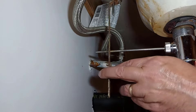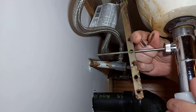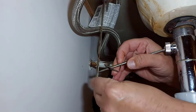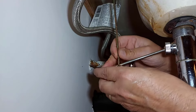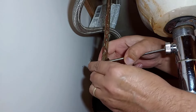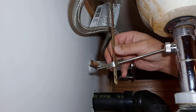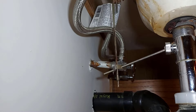Hopefully that is an easy fix for you. All you've got to do is run this clip through here. Your clip may be compressed — you can spread it open wider so it creates friction on this rod. You want to run this clip through here first, and then run the rod — or that drop-down bar — through it. You can fit that clip up on that horizontal rod. Push it forward a little bit so it's pretty much up and down. You can see there's lots of friction there — it will not slide off anymore.